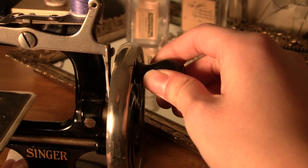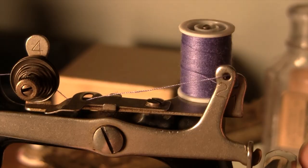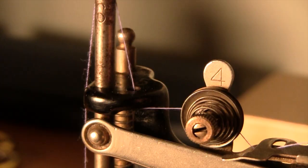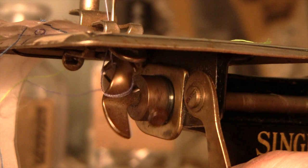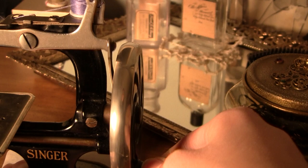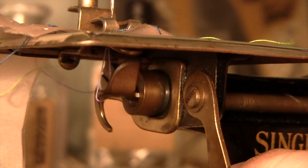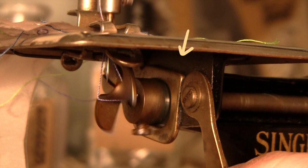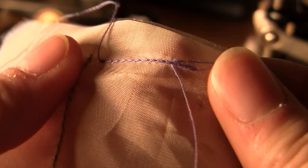The mechanics of these cast iron chain stitch machines stayed essentially the same throughout all of their iterations, but what made the 1910 to 1950 Singer Model 20 unique was that all of the moving parts were exposed — something we haven't typically seen since really early on. Here you can see a video of how the chain stitch mechanism works from under the plate of the machine, and it's absolutely mesmerizing. Turning the hand wheel moves a metal bar, which raises a lever, allowing thread to pass through to the tension knob. Then the needle is raised and lowered, creating and catching loops in the mechanism below the plate. The feed dog is moved by the turning of the looper, raising and lowering the plate. When you want to stop sewing, the needle is raised to its highest point to open up the tension lever, some slack is pulled, and once you raise the presser foot and wiggle the fabric around, you get a very neat chain stitch that's knotted itself at the end of the seam.